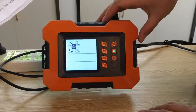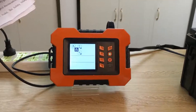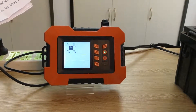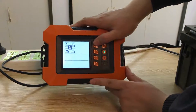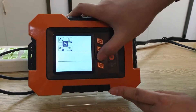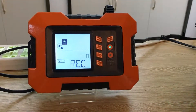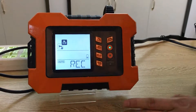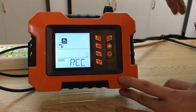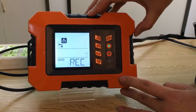The last one is the conditional mode. When a battery is not used for a long time, the voltage will decrease and it can't work before you treat it. When you choose the conditional mode, the LCD shows REC — so it's retreating now. When finished, the battery's voltage will show on the LCD again.